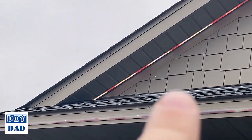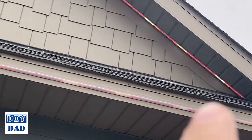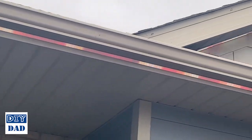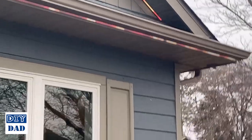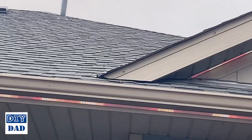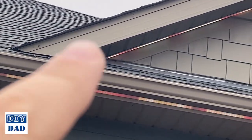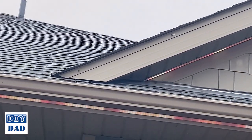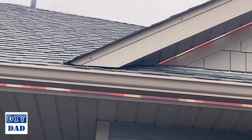For the peaks, there's a small hole that comes out of the side of the garage right here in the corner and the wire feeds out of there from the control box. It then runs up through the peaks and back into the garage, and I ran it through the ceiling of the garage, brought it back out, and ran it behind this conduit until about even with that corner of the peak. It actually comes up behind my rain gutter and comes out — the only part I don't like and will eventually change is a small section of visible wire that connects up to the peak, providing the signal and power for that half of the secondary peak. I have connectors hidden up in the soffit so I have some ability to maintain this as we go.